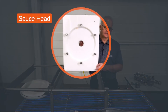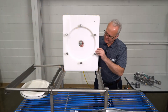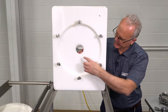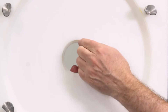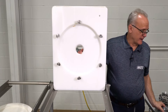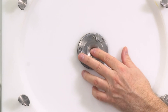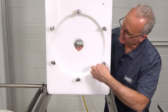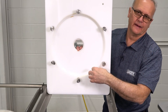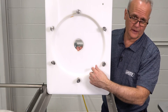This part here is called the sauce head. You notice that this side is cut out — when I lay it down, you'll see that the top is all flat. One of the things you have to look at before you install the pump or the insert is this area right in here. We need to make sure there's no gouge or chip or the plastic is torn in a burr fashion, because the discharge valve assembly gets inserted from this side. Also check this part right here — run your finger around it, look for a burr. That's where the sauce insert seats, in this little groove right here — that's where the o-ring will seat.